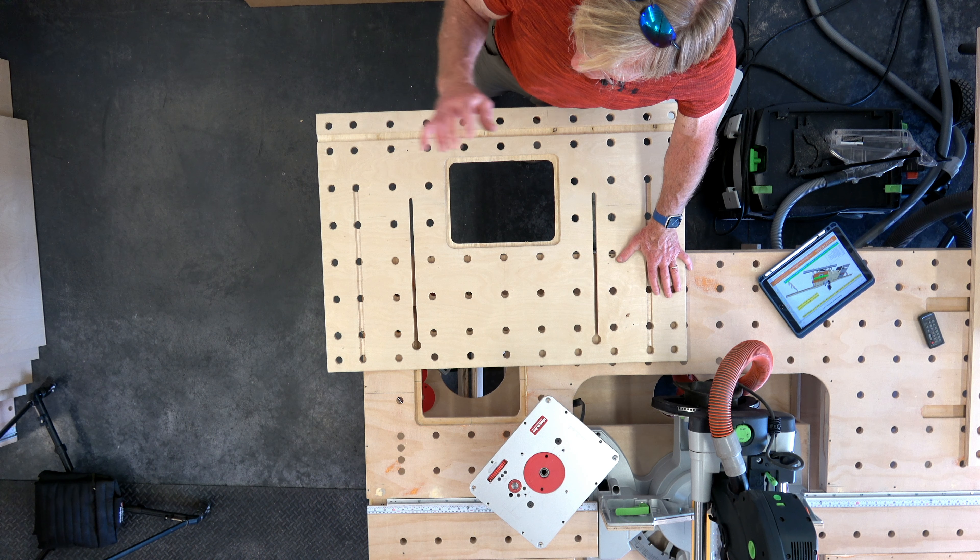As other videos come up you'll see these in operation — they've been used quite heavily, which is how I figured out I wanted to make a few more adjustments. I have a video coming out that shows how to make this router fence, but you'll see that when I made it I used a 5-inch hole saw, drilled the hole through a single piece of wood, ripped that piece, and then assembled it into this corner. I made an update to make it simpler to build — I needed 2.5 inches height and 2.5 inches depth. I've just made this into a rectangle on the bottom and top, which can be done with a jig in your router, or on your table saw, miter saw, and jig saw.